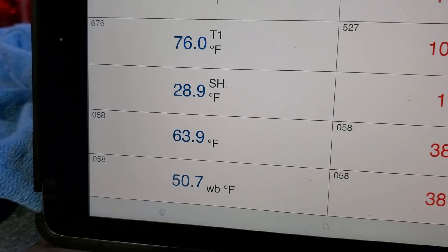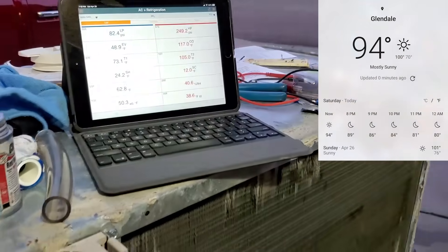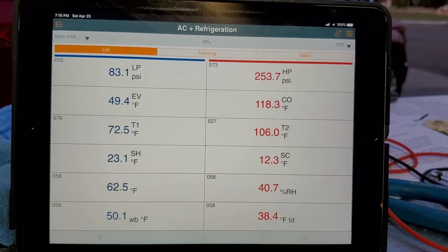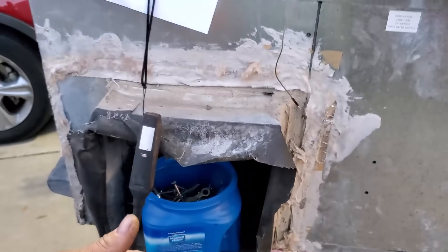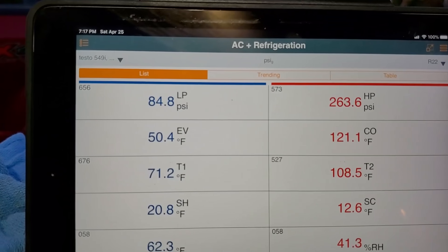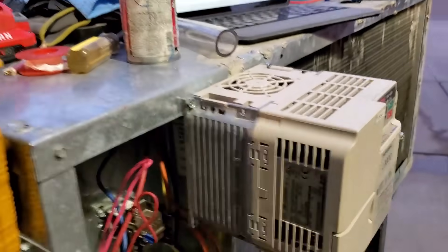It was closer to 100 degrees today — checked the app and it's 94°F ambient, so a 62°F supply temperature is awesome. This supply fan is probably blowing a little slower than the previous one; the blower wheel was made for the three-ton unit but this is only a two-ton compressor. Still, that air feels nice coming out. At time 7:17 — three minutes in — we're at 264 over 85, still getting 62°F supply, compressor at 60Hz, total system amps at 15.